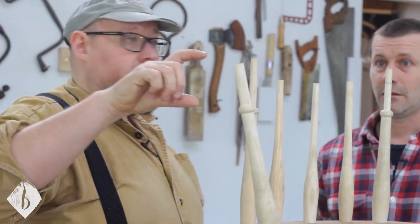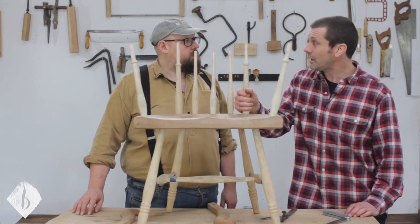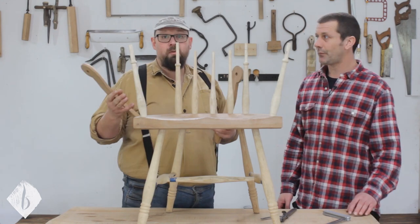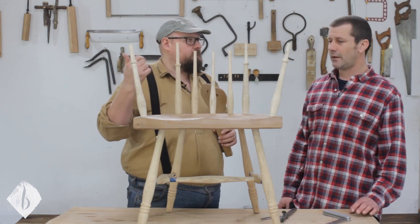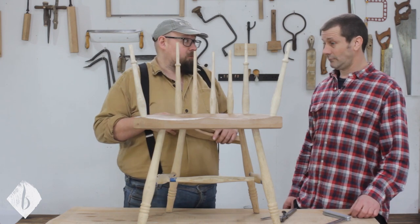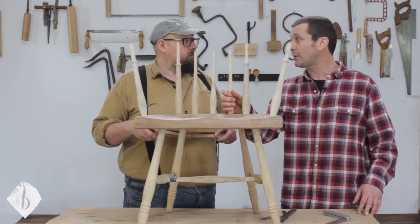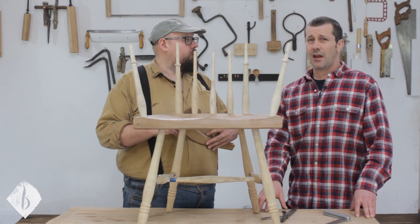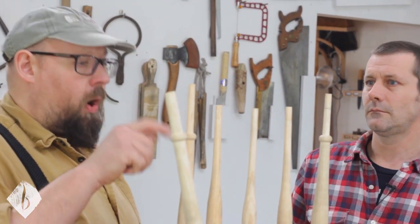A captain's chair is normally jointed, but we're trying to keep it simpler — maybe a little more folksy and rustic, more accessible. There is a lot of kit involved in making Windsor chairs, and we may show how to do a steam-bent one another day. Our arms and crest have all come from the same plank as the seat, so in theory you should be able to get hold of one difficult piece of wood — the plank — and then these things can be made from all sorts: sycamore, beech, fruit woods. Pine would be fine too; we're not pushing the tolerance of the wood.